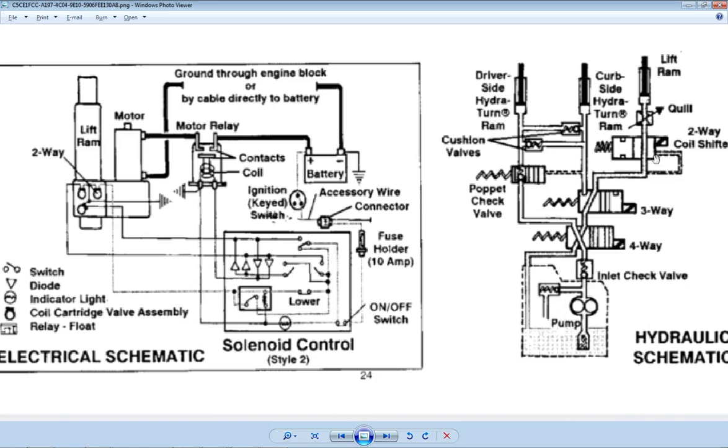This diagram is shown with all valves off, so this is easy to trace. Turn the pump on — pressure comes up through the four-way valve, which is in its crisscross position, pushing pressure over here and running the driver's side actuator, which pushes the driver's side of the plow outward. The plow pivots to the right, the curb side pushes the other actuator back inward, and the returning fluid dead-ends at the turned-off three-way valve. There's a pressure relief valve there, so pressure builds and that valve fires off, pushing fluid from the sump right back into the sump. It won't really hurt anything, but if that valve stuck it certainly would.